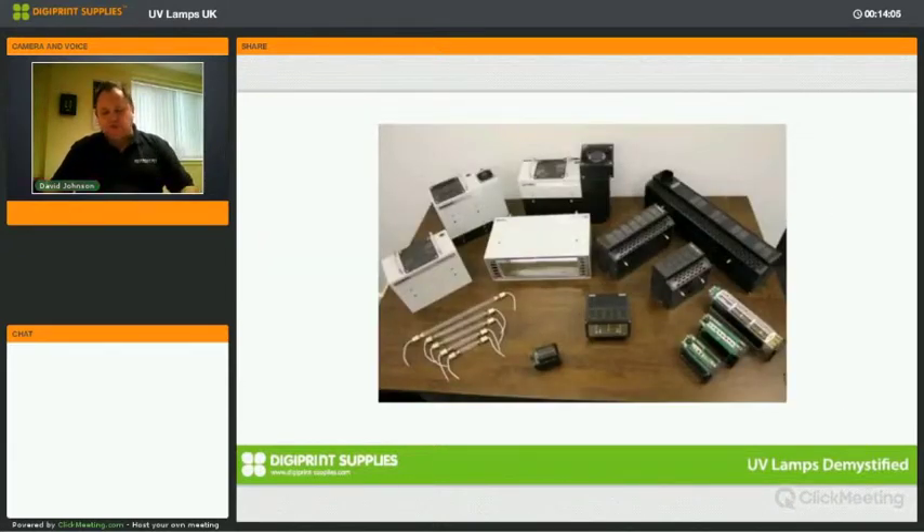This shows a family of UV lamps. On the left is our V0 range — bigger, heavier UV lamps where you change the lamp by making electrical connections with a screwdriver and replacing the reflectors. The black lamp heads on the right are sub-zero lamp systems designed for cassette lamp changes. The object is to keep the cassette price reasonable. When you change the cassette, you get a new reflector every time, putting your system back to prime position with a new reflector as well as a new lamp — so you should get back to 100% output.